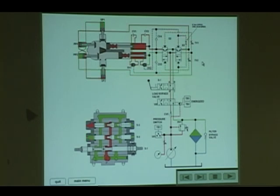So if the augers don't start up until the rams are started at the same time, you have to actually put press cake into the hopper before you start anything up. Right now you have to go downstairs and press the start button to get the hydraulic power pack up and running, right? I understand at some point there's going to be an HMI upstairs for you to do all the same functions up there. But until then, I would definitely wait until you start seeing product coming off that belt, dropping into the hopper. Now, don't wait too long, because by the time you get downstairs, you're going to have quite a bit of cake in there, and you're going to get a big pile right away. So it'll all be in timing.